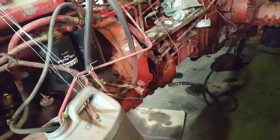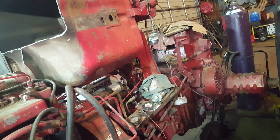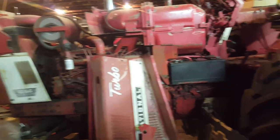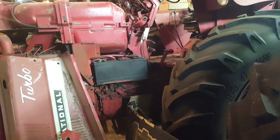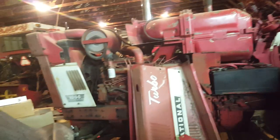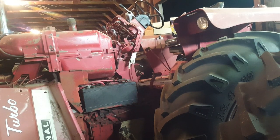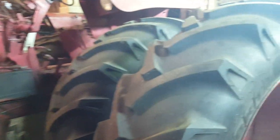So that's what I did on this tractor — hooked that hose up. You can leave it on there for an extended period of time, it's not going to hurt anything. As soon as you get it primed up, just release your hydraulic lever and put your remote back in neutral, and everything should work. This 1066 right here — the gentleman thought the rear end was shot, he couldn't get it to move. Said he was out making hay with it one day, came out the next day, started it up, and it wouldn't move. I bought this tractor for $700, got it home, put the hose on it, primed it up, and that's all that was wrong with it. I've been using it ever since, off and on, and I've had it for about four years now and it's never given me any problems.